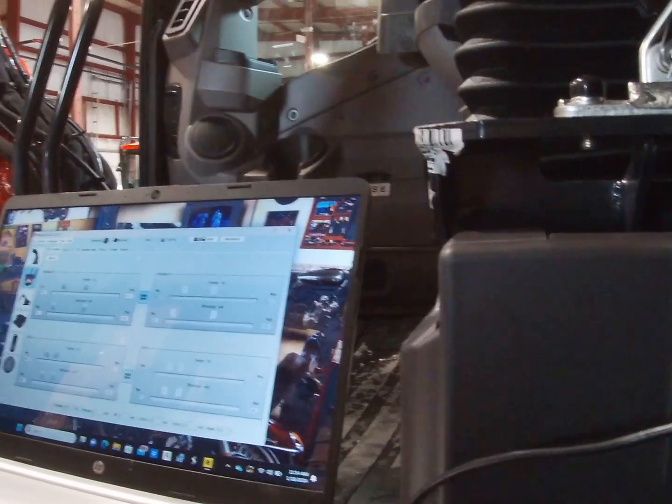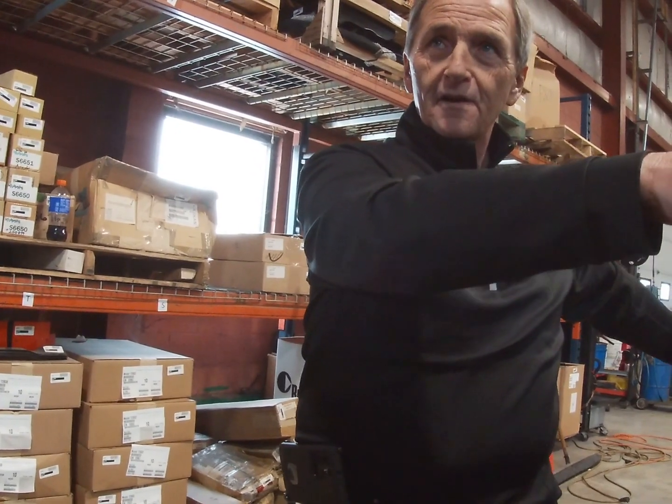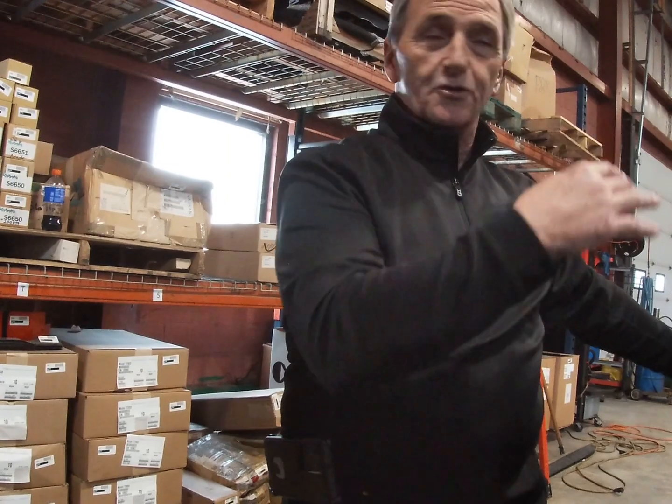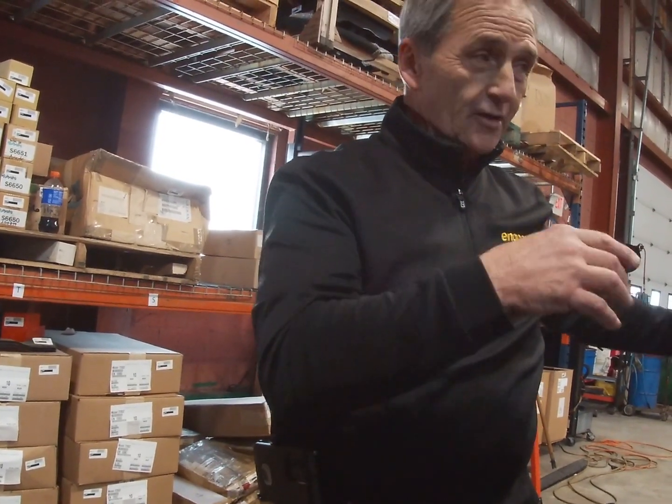If you start putting too much GPM out, you're going to start hearing hissing. If you slow it down there and you're not slowing it down here, it's still going to put out 15 GPM, but it's only requiring 9 GPM. So you lose 6 GPM back to relief, and after a whole day of that, the fluid gets hot going through relief. Yeah, I remember. And you're just wasting energy.